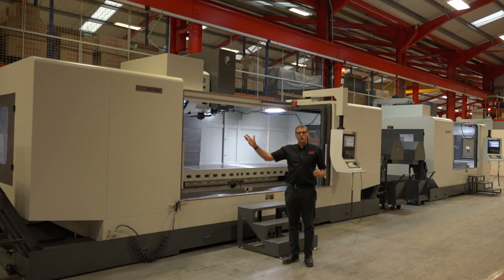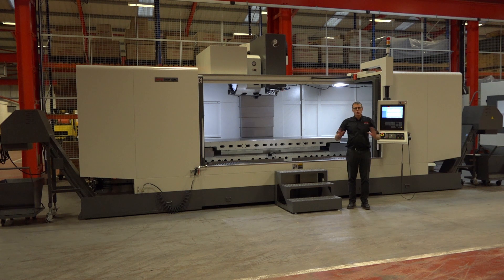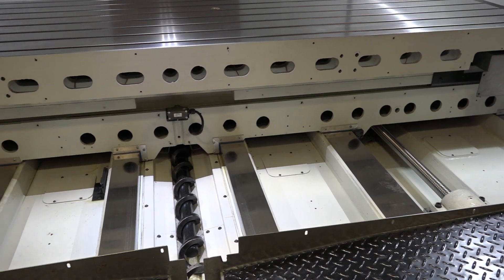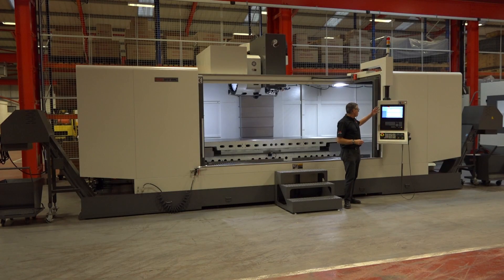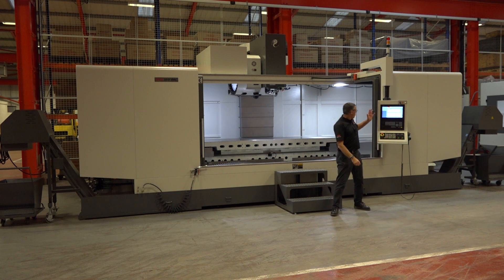And then we arrive at the largest machine in the Super Heavyweight range — the 3010 VMC. On the 3010, everything is just scaled up beyond comprehension. The traverse is now three metres in X by one metre in the Y axis. The table can take four tonnes of component weight, or perhaps a number of different parts to maximise your machining time. There are still six hardened and ground box section slideways, but spread even further apart to accept the saddle of this humongous machine. To make that Y axis move, there are now two ballscrews synchronised together through the software in the Siemens control. Three swarf augers bring the swarf to the front of the machine, then ejected on two conveyors, one either side of the machine.